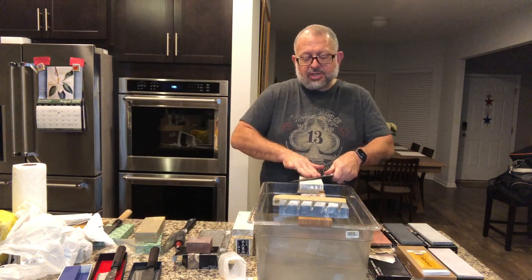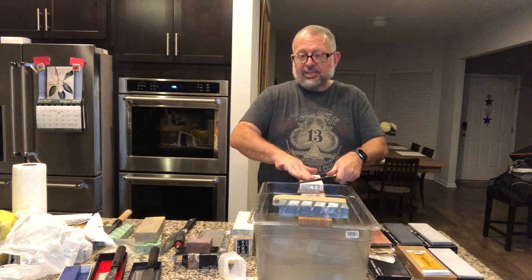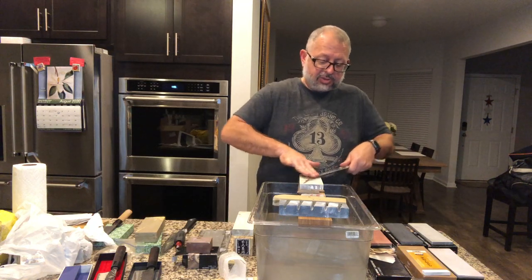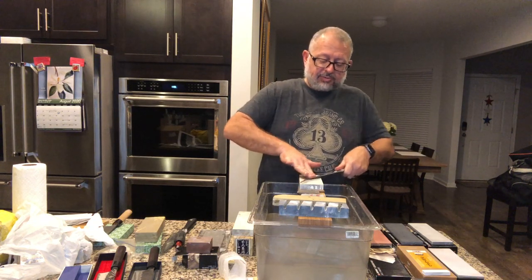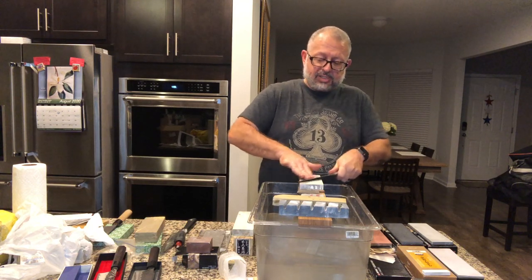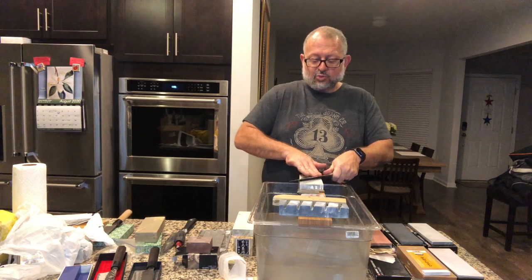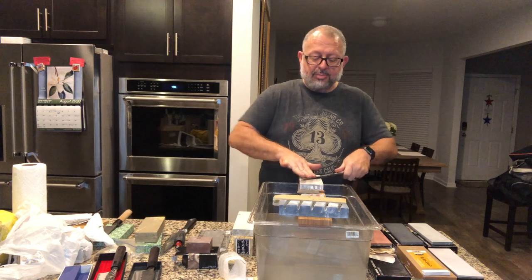Now, when you're done making this, like, laser edge, you would think it'd be like perfectly aligned, but that's actually not going to be the case. You guys have probably all seen a barber with his leather strop and a straight razor, but you've got to realize you created a foil edge, and that foil edge can roll over and be like not perfectly aligned. And so a barber who sanitizes his straight razor, he still needs to realign the blade so he'll move it back and forth on the leather strop.